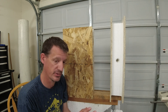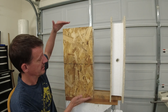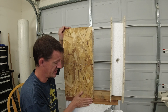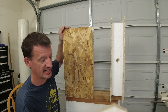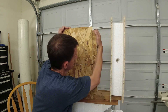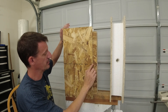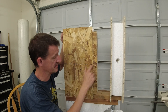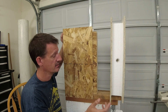The first piece you put in when building is the bottom plate, inset a half inch back so all of your bearing area on the exterior sheet is being transferred down into the mud sill. In between panels you've got splines — that goes in right there and the electrical chase goes through both. The chases are marked on the exterior; when they come from the factory they've got black or blue lines painted on so you know where they're at, making it easier once the structure is up and you're dried in and ready to install electrical.